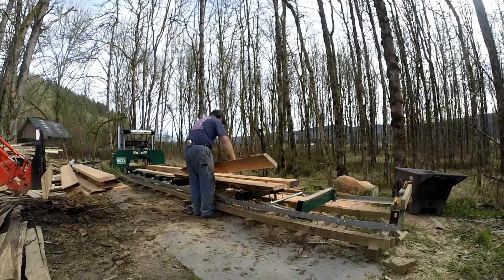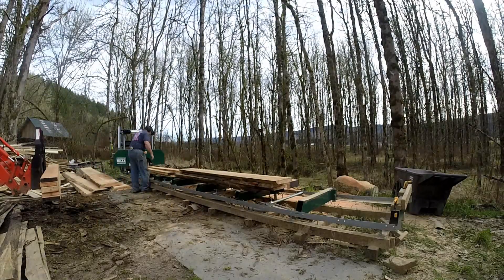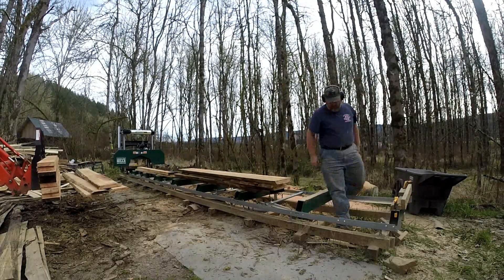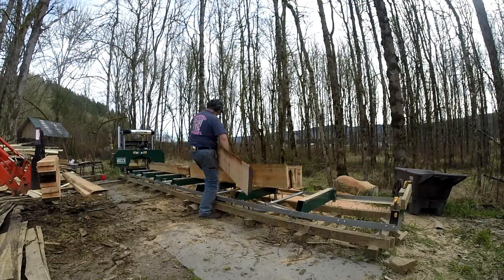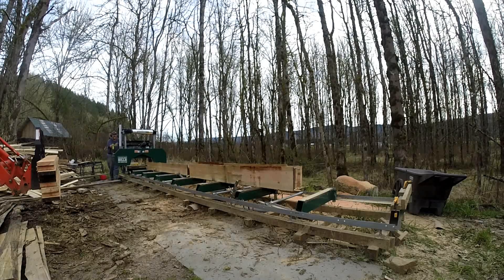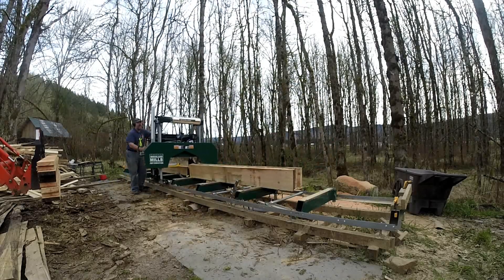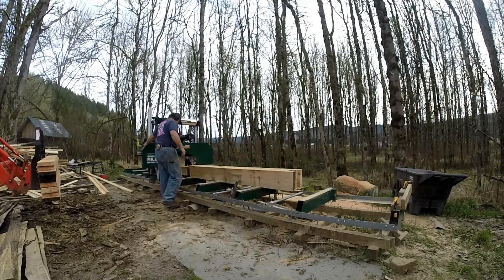Now that I've got those, I can take all of the boards off here and start stacking the finished boards. I'll take all the boards that are single-side live and put them in one spot, and all the ones that are double-sided live in front — work my way through and trim those down, end up with a few scrap pieces for kindling and tinder, and then a few one-by-twos I can use for stickers. Then you flip the boards that now have one live edge and one flat edge over and do the same thing with all of them.